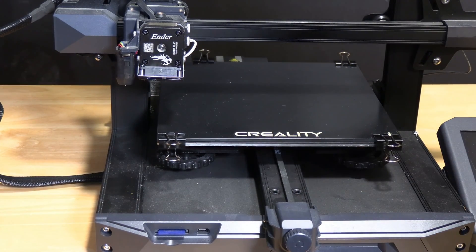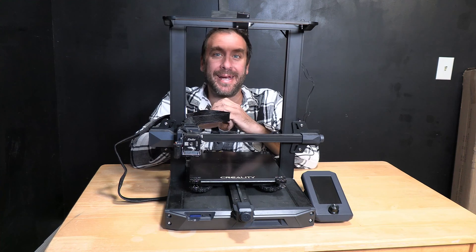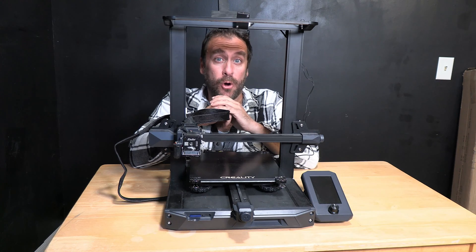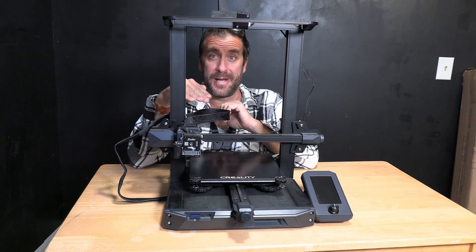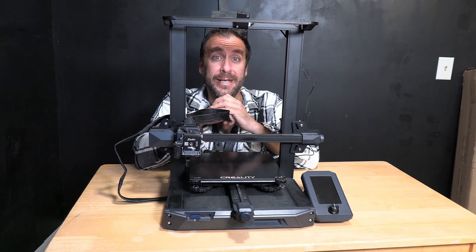And you're done. That's all there is to it. I removed the magnetic bed, I clipped on the glass bed, and I'm done. Now before you print, your tramming and your Z offset are always your responsibility. I would check your tramming with the paper method, check your Z offset also with the paper method, and run a new auto bed level. Then run a test print and see how it goes. If you have any issues, please visit my Z offset video on how to dial that in perfectly for clean first layer prints. Other than that, your process of tramming and setting your Z and auto bed leveling mesh should be very simple.